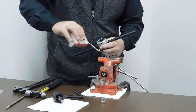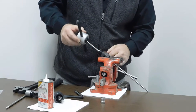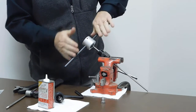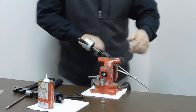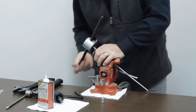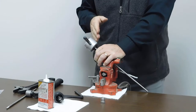So we put a little bit of lubrication on the end of the tubing and put our threading tool on there. As you can see at the end of the threading tool, there's a guide bushing that's the same size as the tubing you're going to thread. That goes over the tubing until it just touches the end of the cone. Now I'm going to push down and rotate counterclockwise until I start to feel that first thread cut. Once I feel a cut, I continue putting motion against the tubing until we get the first one or two threads cut in. In the catalog it's about 11 full turns. My rule of thumb for quarter inch high pressure tubing is when the cone actually pops up through the end of the die — which tells me I have enough threads on the tube.